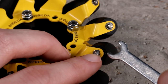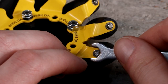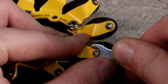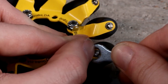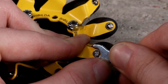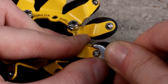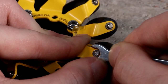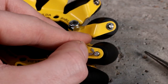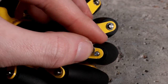The first step is to grab our substitute e-clip removal tool and line up the open face of the e-clip with the open face of the wrench. Normally I'd hold my finger over the e-clip so it couldn't go flying, but we're going to take the chance today so you can see exactly what goes on. We're just going to apply some pressure — you can see it flex — until we get it to snap off.